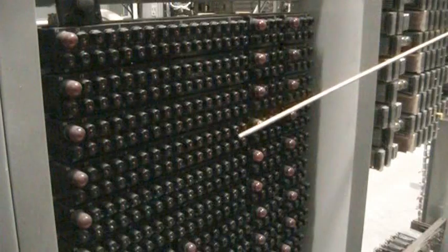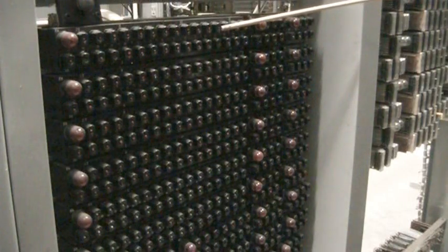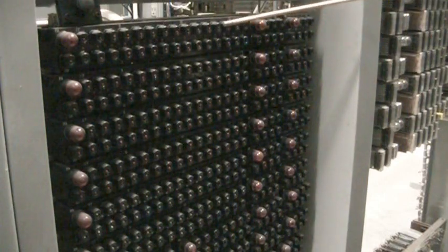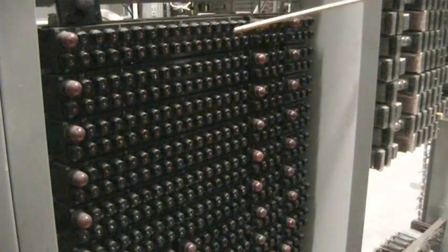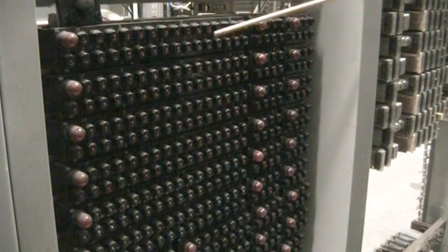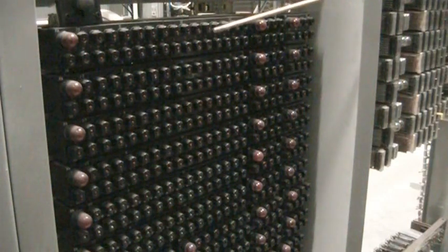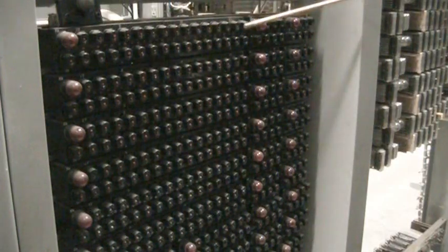These Type 70 fuses are in the circuit between, let's say for an example, a dial tone source and a register or a trunk. Unlike in a step-by-step system where the tones are connected from a grounded transformer with one lead to ground and one lead to the equipment with tones superimposed on it, in the crossbar system they superimpose the tone onto the negative 48 volt battery system. The reason for that was if a trunk or auxiliary piece of equipment such as an originating register was to develop a problem, it would blow the Type 70 fuse, and then it would isolate that piece of equipment from the rest of the tone source in the office.